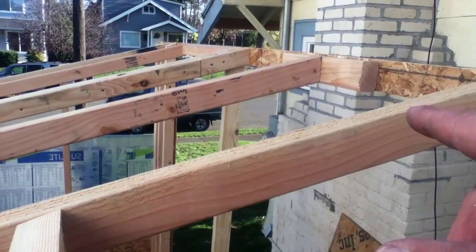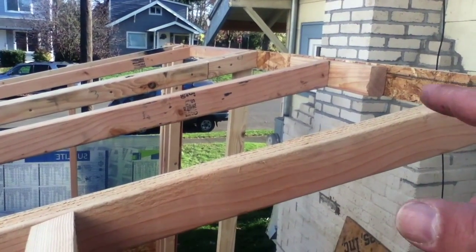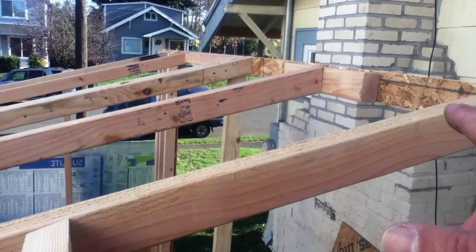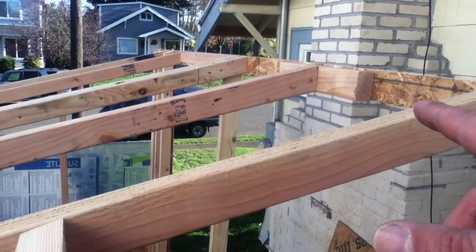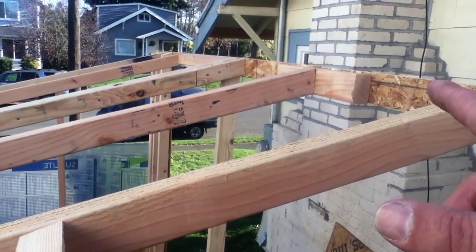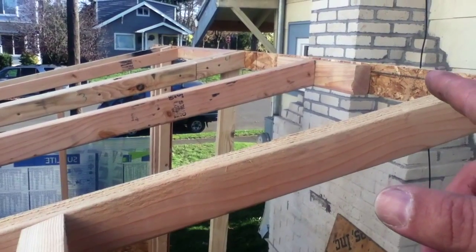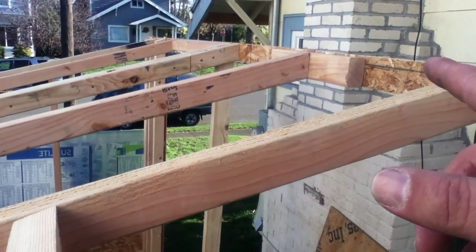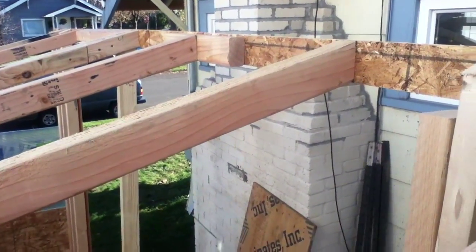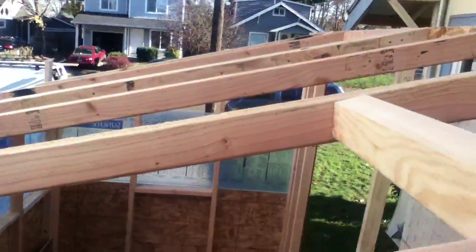You can see where one of these beams was actually made from a couple others — that was a miscut — but I decided that since that's the center and we're not super strong with the two-by-threes, I was going to triple that up and basically make a laminate beam out of that. With the roofing material we're using, it comes in 79-inch lengths, which barely gets me long enough with very little overhang on everything to get down to the tips and still compensate for the angle. It's a kind of odd thing that it's 79 inches, but it's going to work out really well.